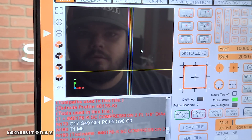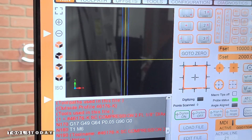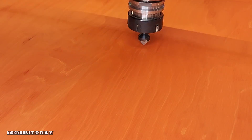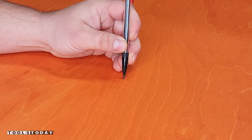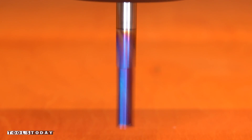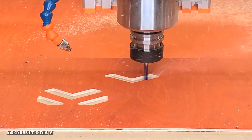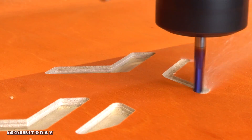I love using the Stepcraft CNC machine because of the UC CNC control software. It gives you a preview of what everything looks like within space, so I know exactly where I can use some brad nails to help hold this down. My vacuum is definitely not powerful enough to hold all of this in place while we're cutting, so I use that to locate my brad nails so that I don't run into those while we're cutting.